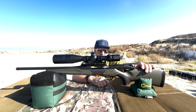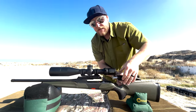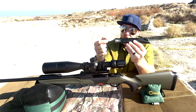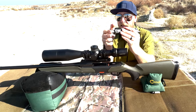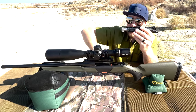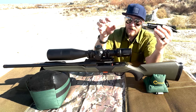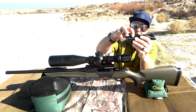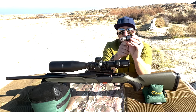I'm going to pull this bolt out real quick to show you some of the things that really stand out. Here's the bolt system of this rifle. The way it operates is when it goes into the forward position, it actually cams — there you go — locking up inside the chamber. You can see all these lugs on the bolt face. As it goes in, this little tab rides in a groove and then cams into place, locking it in battery.